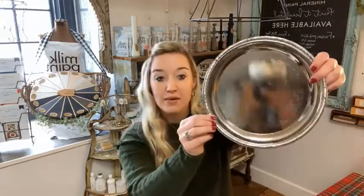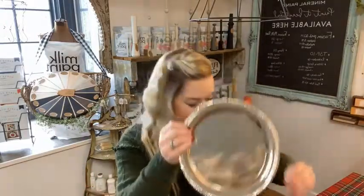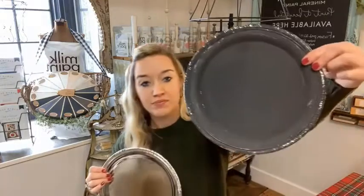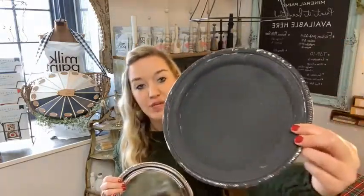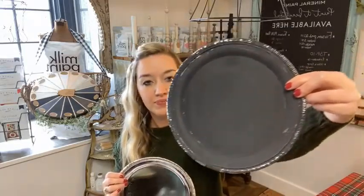Same with a very shiny metal surface — like a filing cabinet, you would probably want to use the ultra grip. Here's my example: I painted it out and I did get some adhesion, but I also have a lot of chipping. Thumbs up if this is making sense to you guys. Think in your head of some surfaces you could paint at home — now you're getting an idea of how milk paint would react to those surfaces.